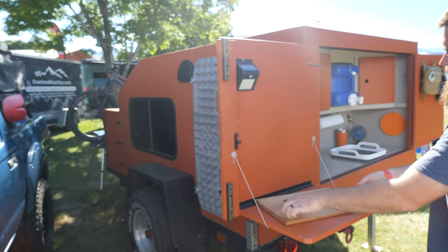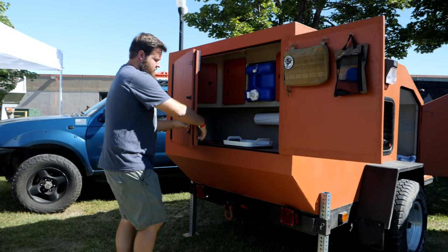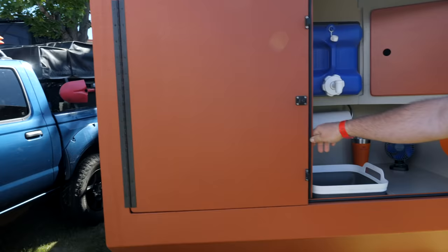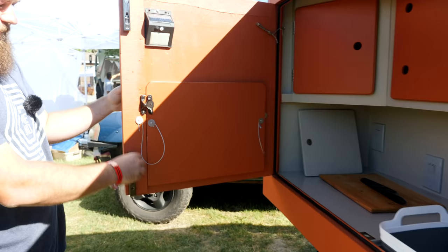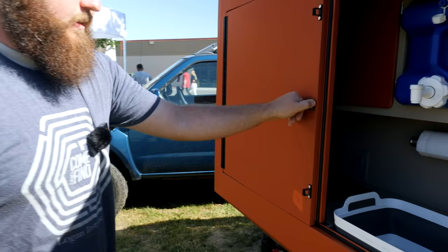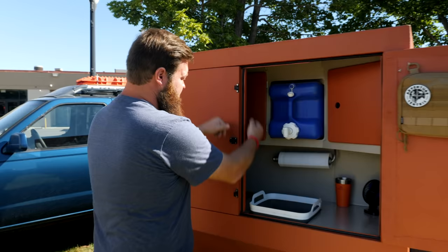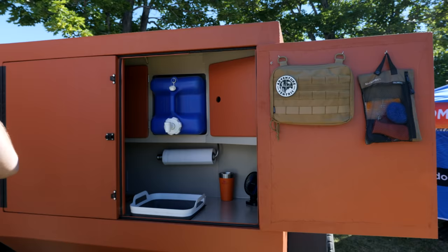Another feature that might be useful if people are thinking about building one — originally I was going to do a one-piece door, but when you're building a wood-framed trailer, it puts a lot of stress on hinges to have a door that large. So I decided to do the two-piece, and you can actually find these locks on Amazon — they're for two-piece household doors and they go down into the floor and up into the ceiling. Essentially you can have your flange right here that the door will hook into, and these just tighten really well and make that door super sturdy, giving it a really good foundation to latch in so it's not going anywhere.